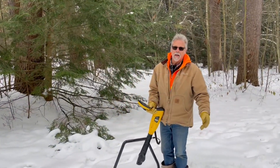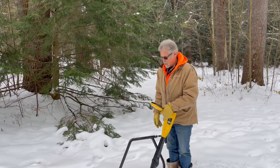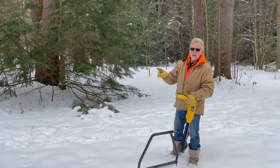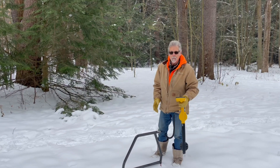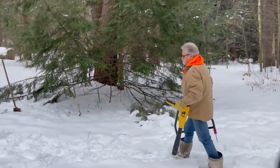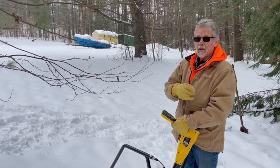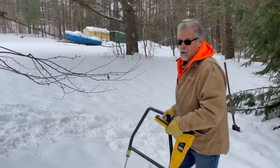Now the number has gone to 68 from 54. I know I'm getting close to where this conductor is because I previously located it. That's where the conductor is — even stepping off the line, the A-frame still takes me to the damage. The signal is peeking up ahead of us, so let's keep going. Coming back to the next spot and sticking it in the ground — now I'm at 95. I was at 80, then 54 back there, which means I'm getting closer to the pool of current caused by the fault itself. Good news.